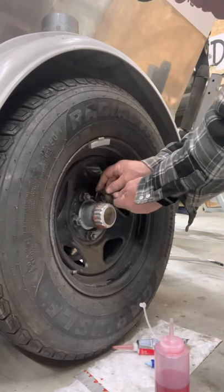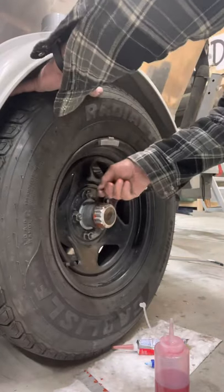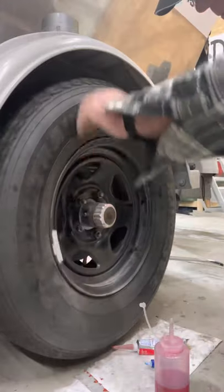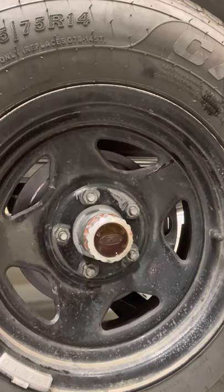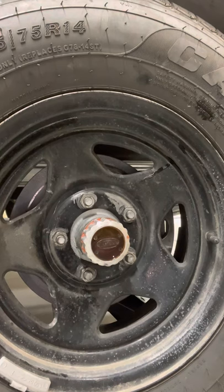I had a friend whose plug bound up and it took him a couple days to deal with — had to pull the hubs off and pull everything out, because if you drill it you risk getting metal shavings down into the oil cavity. There she is — the oil level is just slightly above the Reliable emblem. This isn't rocket science; you'd be good with a hypoid 80-90 weight gear oil. I just decided this year to try the synthetic given my experience with it at the power plant. Thank you very much.